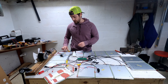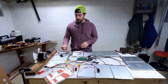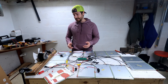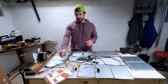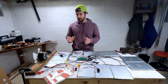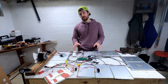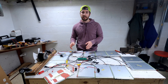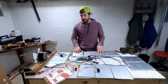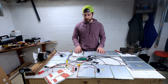I've tried a couple of things to get through this — XT90 anti-spark connections, using the controller with individual packs to reduce that initial surge, and I also tried — which wasn't a good idea — just hooking up straight positive and negative directly to the motor, which of course caused a big arc and really didn't work well. I'm at a stalemate because I don't want to invest more money into a speed controller that can handle the amps, and I also don't want to leave this on my workbench anymore since all these exposed wires are a big fire risk.